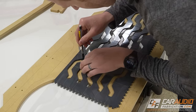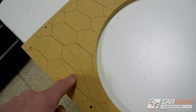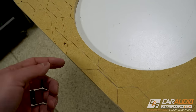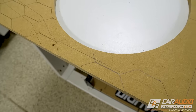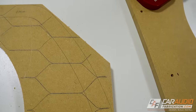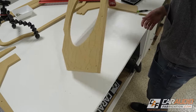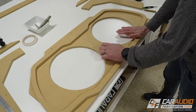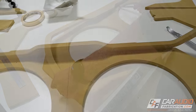I can now plan out each of my specific magnet mounting positions. I'm also using the Mobile Solutions Matrix template to add a pattern, drawing it on now because I'm going to be machining this pattern onto the front side of the piece — so I want to avoid placing magnets where the machine grooves will be. For example, this would be a good location for a magnet here, whereas right here is where I'm going to have that groove. To mark each planned spot I'll use a punch and draw a pencil circle around it, then template tape the insert to the front side and take it to the drill press to transfer all the holes.